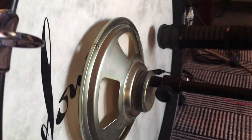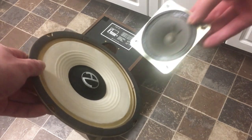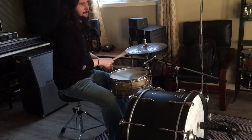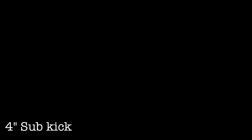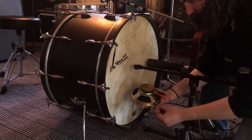If anyone has a better way of doing this or building an attenuator, please let me know in the comments. Before I built the attenuator, I went out and bought another speaker box from a thrift store, just in case the first one didn't work at all. Next, we'll compare the sound of three different subkick cone sizes: the 4 inch, 6 inch, and 8 inch. The 4 inch one didn't really work at all — I got one little squeak out of it. So we're going to move on to the 6 inch and the 8 inch cones, which had much better results.